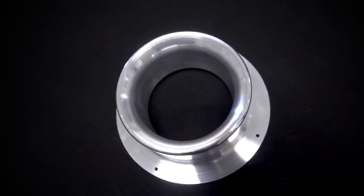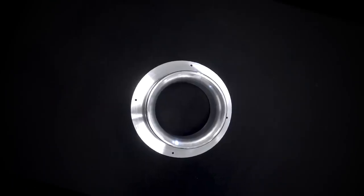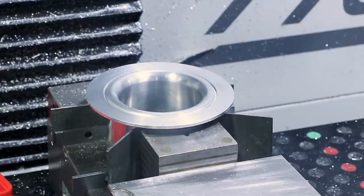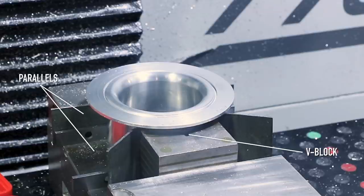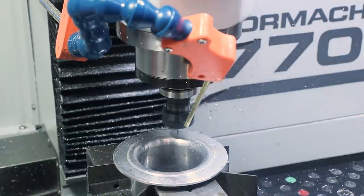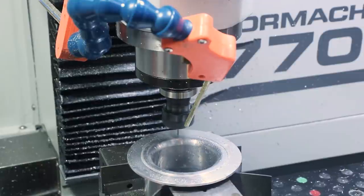In this video we were turning an aluminum jet engine intake for a collaboration with Andrew Barth, and we were done with the part with the exception of a relatively shallow groove we needed to mill on the back face. It was a very low force work holding requirement and we didn't want to mar the part, so we used a combination of a vise, a set of parallels to lift the part up, a v-block to give us two points of contact on the front side of the round part, and some scrap soft material as a cushion — a balance of strong work holding without any marring. Adding some painter's tape or powder coat tape wouldn't have hurt here either.